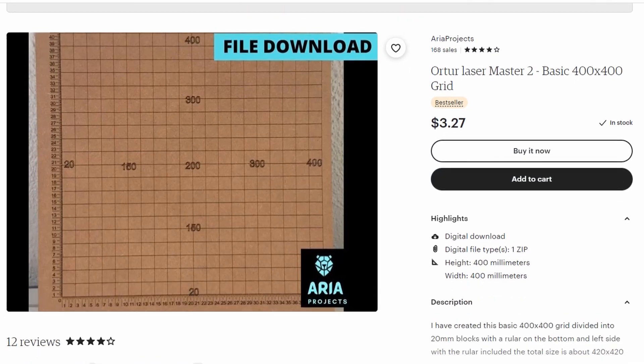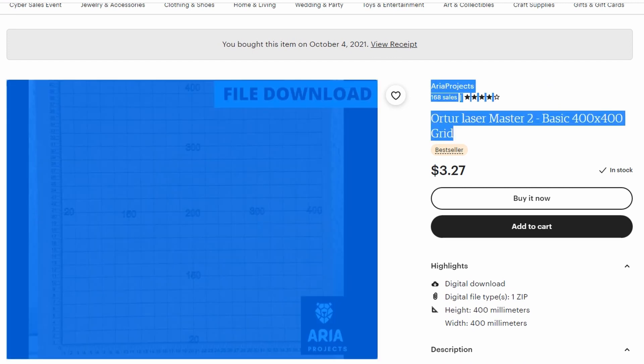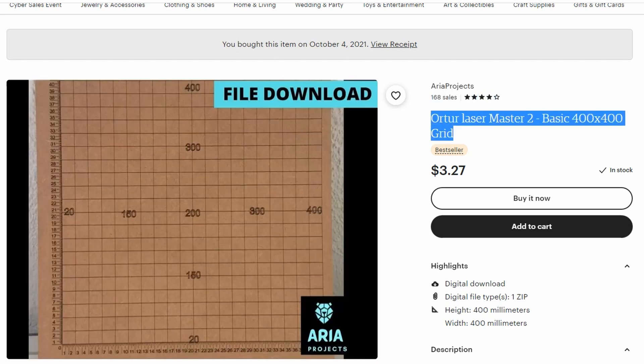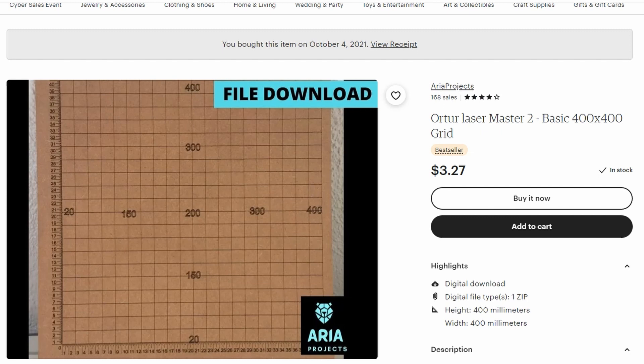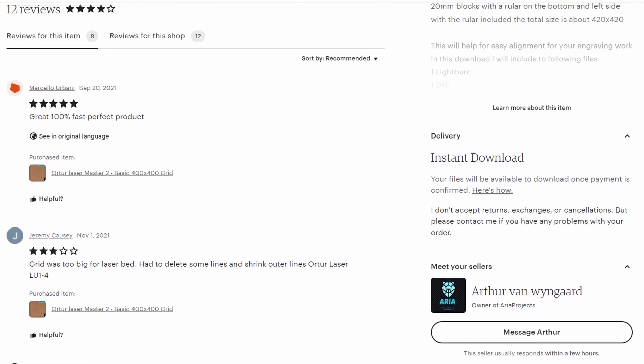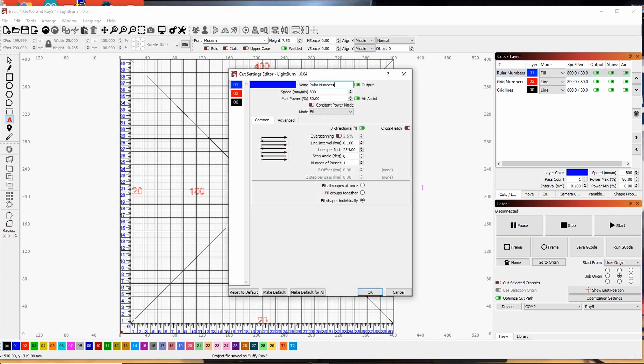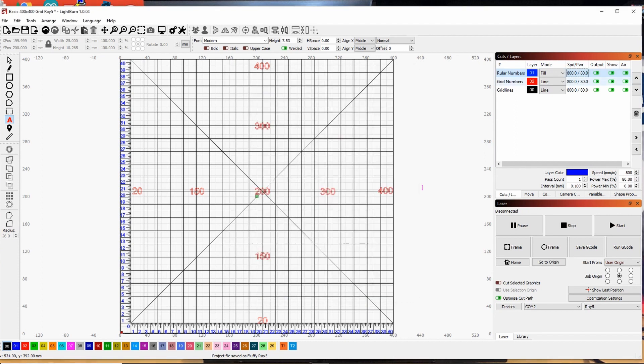You may have seen a waste board during the build process, and that was actually for another machine. As I was testing this laser engraver, I posted some of my projects on the Facebook group, and a lot of people had interest in the waste board. So let's go ahead and show you how I did it. I went on Etsy and found one for another manufacturer — I'll leave the link in the description. I imported the file into Lightburn, and you'll see that it has three layers, and each of them could be adjusted to a different power setting. All you do is make sure you max out the grid.